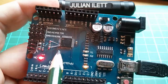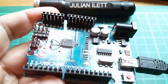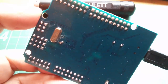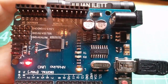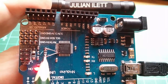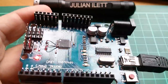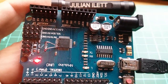You can see the two wires coming up from the crystal, which is now on the bottom of the board, onto the two crystal pins which just happened to be conveniently close by. I will upload this video now and I'll probably keep this board, because although the crystal's a little bit impractical sitting on the bottom, I was using this board on standoffs on one of my wooden project boards so that's not really going to matter too much. What's the point of throwing it away when it works? This video was really just to highlight the problem of the crystal sitting down on those surface mount pads - that's what caused this thing to fail. It's turned into a bit of a marathon soldering and getting cross episode, but there it is - fixed. Cheerio.